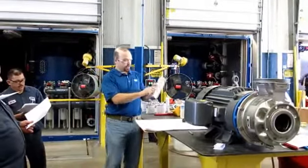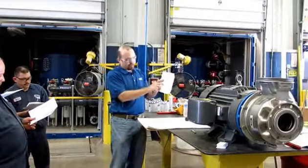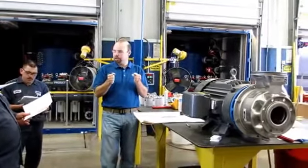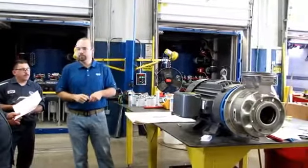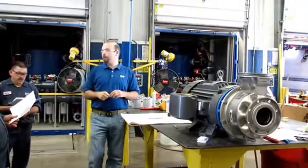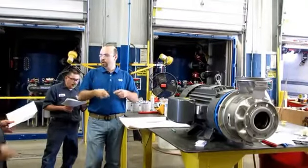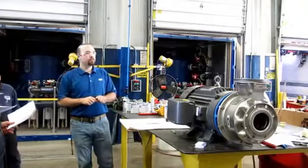You've got a nut or bolt — in this case a stud and an impeller washer — basically a bolt that holds the impeller onto the shaft. All that does is hold it tight against the shaft and sleeve. Then you've got a key that drives it and transmits all the torque. So if you drop a screwdriver in this pump and turn it on, you're probably going to shear the key. The bolt might still be intact, but the motor runs while the impeller doesn't. Or if you spin the pump backwards and then start it up, that's a classic failure mode.